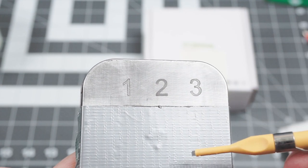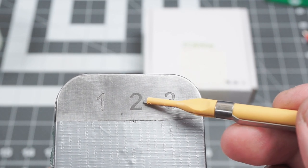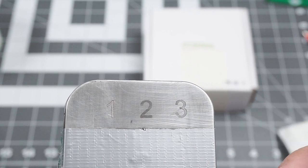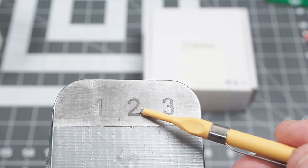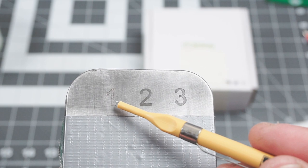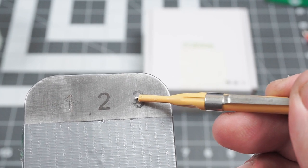With an AC power supply, the shapes will be marked on the surface of the part, forming a dark oxide layer on the very top surface of the object. This process should not etch or eat away a large amount of material from the object. Essentially, the marking will just be a changed color on the surface. Even though the marking made with AC is quite durable, it will eventually wear off. To have the advantages of both methods, DC is often used to etch the shapes, followed by AC that adds the dark color which makes those etched shapes really pop out.